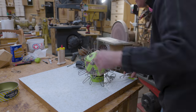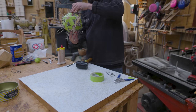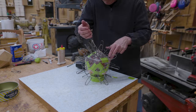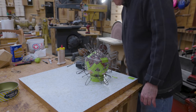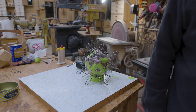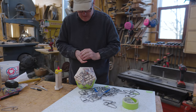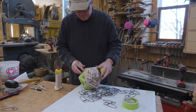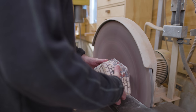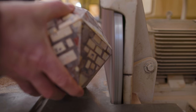Also, cleaning the work surface so the tape didn't have dust on it helped, as did understanding better how the pin clamps work — if you pin them into the actual pieces of wood that works a lot better than just throwing them on, because if they hit the resin they don't tend to stick very well. My fear that night as it dried was that I'd screwed up a triangle and it just wasn't even close to a globe. But when I took the tape off and looked at everything, it looked like it made sense.